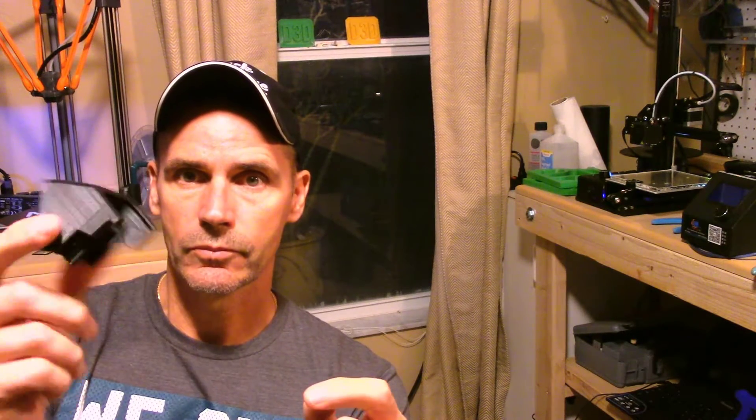I'm hoping it makes my printing experience on the Ender even better. You might remember from the last video I was trying to get a green version of this part off of the platform. This is the part you just saw pop off at the beginning of the video. Obviously it was very easy to remove the supports — I did change my support settings in Cura to help that — but having it print on glass versus the BuildTac made it easier as well, for sure. So yeah, this is my success story right here.